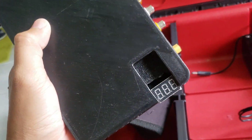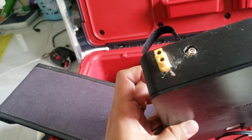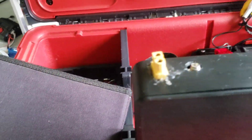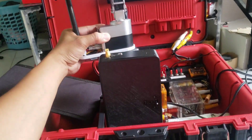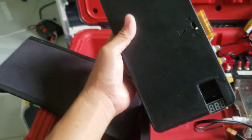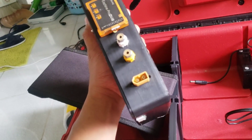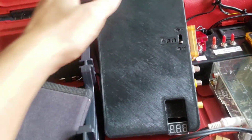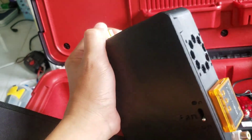The relay box has its own voltmeter to display the battery voltage and an auxiliary XT60 port on top for powering my Crossbow antenna tracker. I have this installed on my tripod — the tracker is on the tripod itself and underneath it has this relay box, so I can strap it on a tripod and connect the battery on the XT60 port to power everything. Since it's also a relay, it has its own 5.8 GHz VTX which needs its own cooling system, so I have installed a fan here.